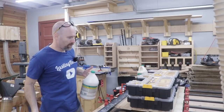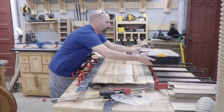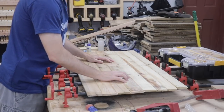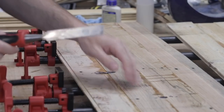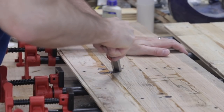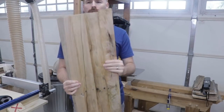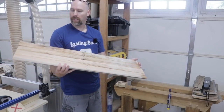It's been overnight since we glued up the panels — let's go ahead and get the weight off and unlock the clamps. There's oak and there's pine here. I didn't glue the oak and pine together into one solid panel — I didn't put any glue in that joint — so I'm going to gently try to pop these two apart without breaking anything. There are a few spots where the glue built up a little bit on the back side, so I'm going to gently scrape that off before we run it through the planer so I don't gum up the planer with wood glue. We got a really nice panel glued up using the tongue and groove joinery.